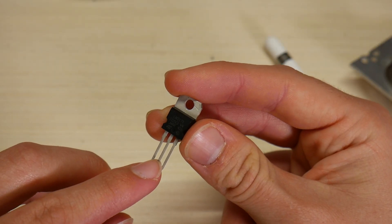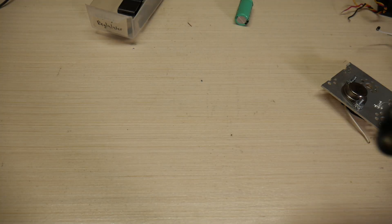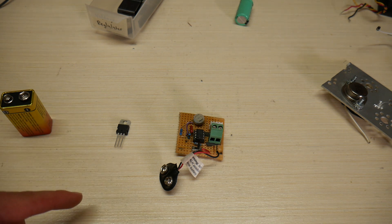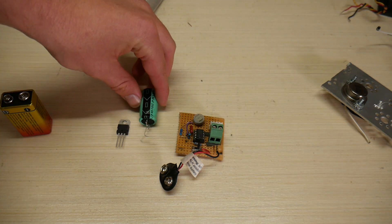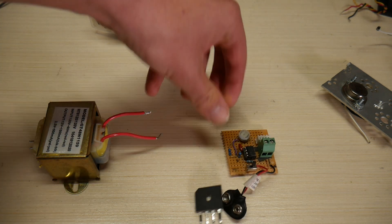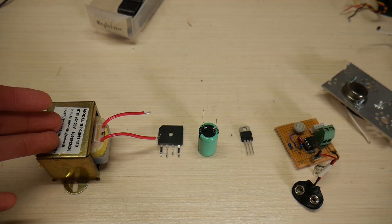For the LM317, you can add a voltage divider to the adjust pin to control the voltage output on the out pin. Now, when you want to supply power to your circuit using a battery, you typically just have the linear regulator in between with the resistor if you're using the LM317, and you add a capacitor before and after to make sure the voltage is smooth. When you want to power your circuit off AC voltage, you'll need a transformer, then a full bridge rectifier, a smoothing capacitor, and a linear regulator before your circuit. That is the essence of a linear regulator.